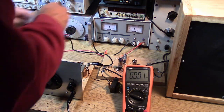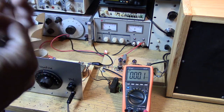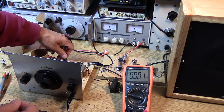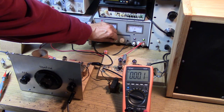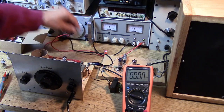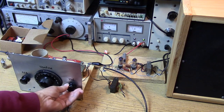We need a 6-something for the output — let's see what we can get our hands on. Found a 6AV6. Let's put that in. Now with this disconnected, let's readjust the power supply. Hook this up. Hopefully the tubes will light. It's two 6-volt tubes in series, so that should be 12 volts. Let's see if we can get this to go.